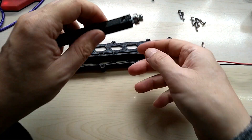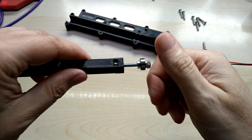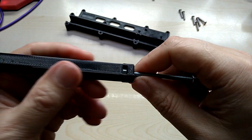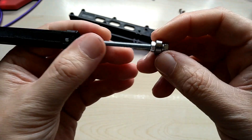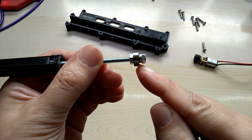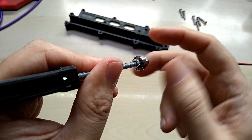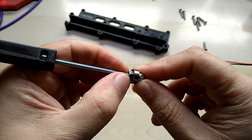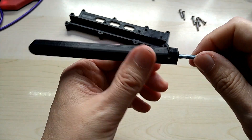You also need a 3 millimeter threaded rod, because you won't find a screw that long. There's a nut in here that is press-fit, and then you use those nuts with a ring on them so they won't turn — they get stuck there. Then you have this bearing, which thankfully fit in there, and then another nut. You squeeze this together so when it turns, it actually pushes the piston in and out.